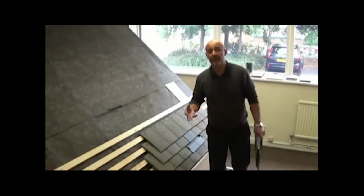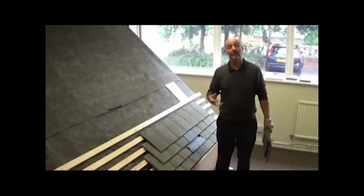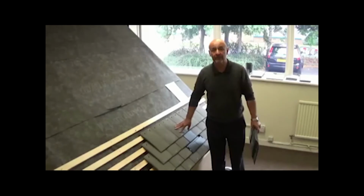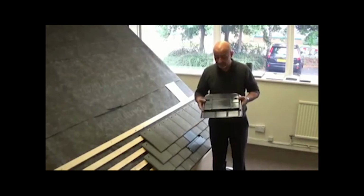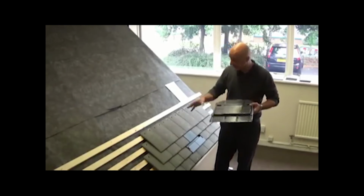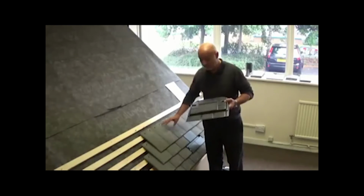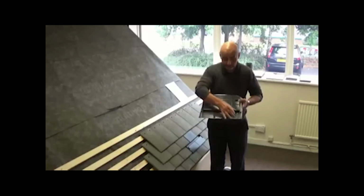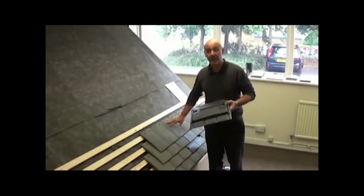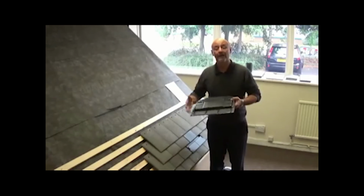Where clay roofs are installed, perhaps in conservation areas or listed buildings, plastic being installed in that roof would be unacceptable. Ubbink have made the UB8 what is called the clay slip, which allows the tiles that are on the roof to be adhered to the actual unit itself, so it totally colour matches the roof, seeing very little or absolutely no plastic.